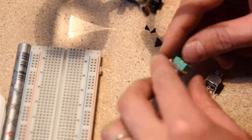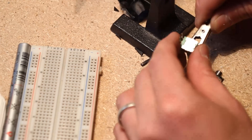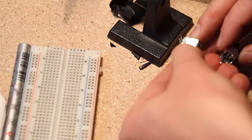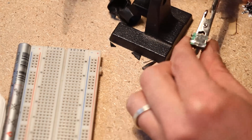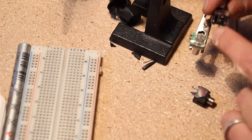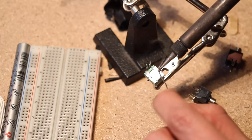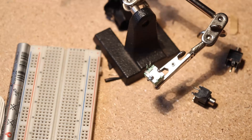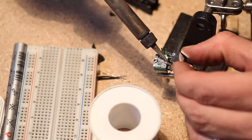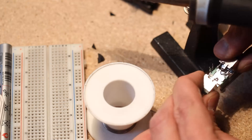To make one, first cut off all the extra legs and attachments at the bottom of the pot. Now take a look at the jacks — one of the legs on the left gets folded back and soldered onto this plate, which will be our ground. Both jacks are going to be soldered to this same ground. Make sure the signal tip leg is facing the potentiometer leads. Turn it a bit so we can solder on the jacks, which provides some structural stability.